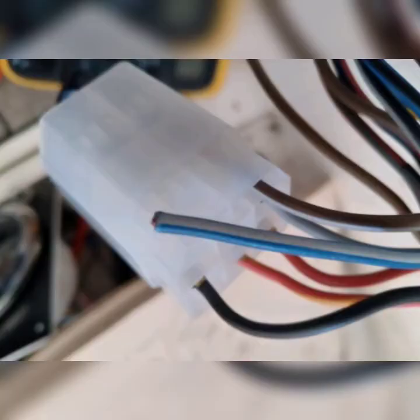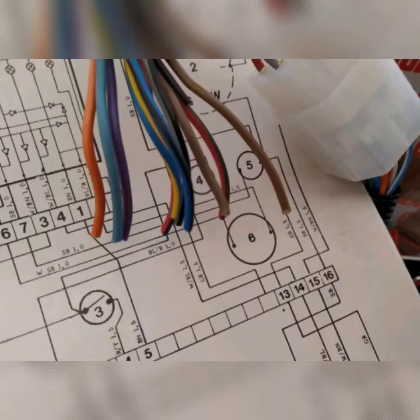Then each wire is checked, check the colour, check the wiring diagram, check the Dragon Marine wiring diagram, put on the spade connector and insert it into the block connector and test to see whether that function is going. This process will take you all day. You should expect the process in total to go from bare wiring to fully connected to take you at least 2 days.